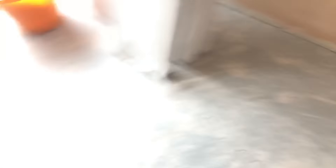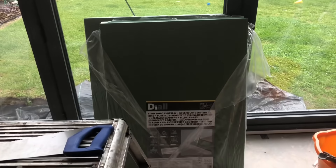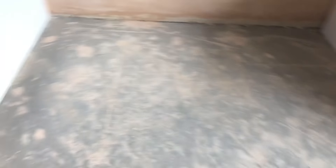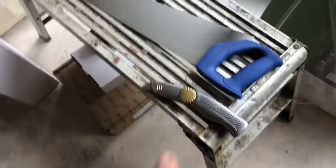What I'm going to do first is put down this underlay. We use this fibre wood underlay — it's 5mm thick, again from B&Q. It spans a good area and it's good if you've got any irregularities in your floor, but of course these floors are nice and level because we've already fitted the 22mm chipboard on our level base. I'll put the underlay down and then show you how we fit the laminate flooring. I've got my knife to cut the underlay and my saw to cut the laminate.